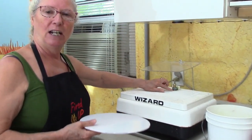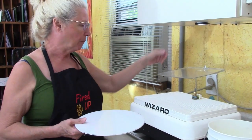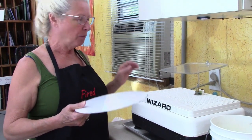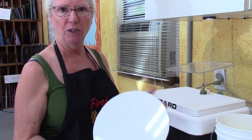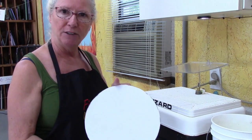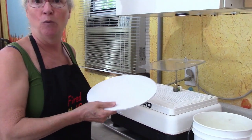I've got my grinder bit right here. Anytime you use a grinding piece of equipment, you want it to have water. I've got some lights up here to help brighten it up. This right here is my grinding surface, and the on/off switch is over here. Now when I grind, I'm going to grind all the way around, but I'm going to hold the grinder a little longer in those places where the black line is, and grind a little back and forth to make sure I get a better edge quality there. It's a little hard for you to hear me when I'm grinding, so I'm going to grind and then explain a little bit more about what I'm doing.